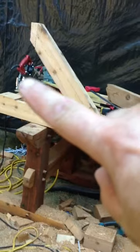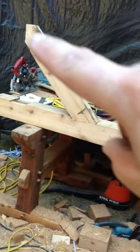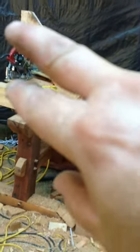And then, of course, there's going to be a beam going from there up to there, obviously going straight across, and that will be mortised as well. And the tricky part is getting all the angles right so that when you put it all together, it's 90 degrees. And it's incredible. And then, of course, there's a tenon at the end to go into the foundation.